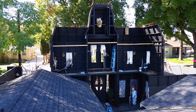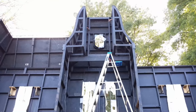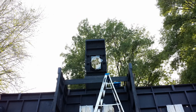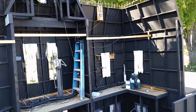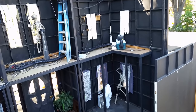We built all the sections in sizes that the two of us could manage, lifted them up to each other, and screwed them into place every foot or so. It's important to use good quality screws because the cheap drywall screws have heads that snap off once you drive them in — no fun when your walls are stuck together and you're trying to carefully pry them apart while hanging 20 feet up on a ladder. Because of the way we designed this facade, we only had to use two jacks and brace the very back corners of the house.